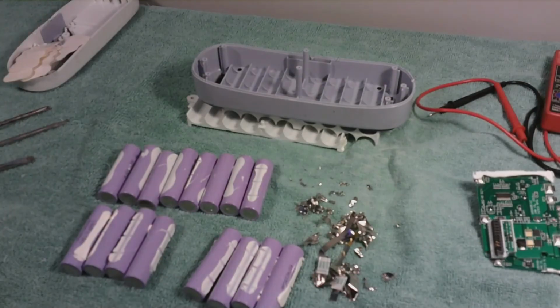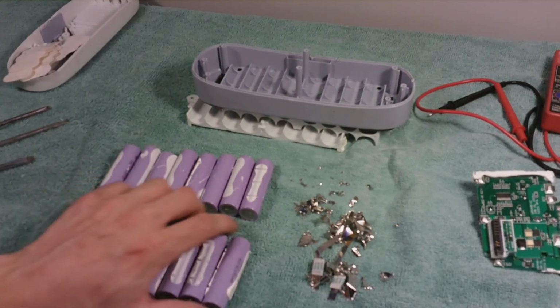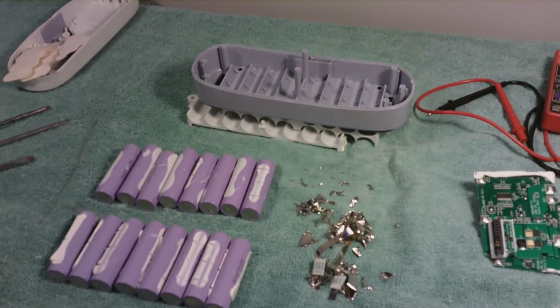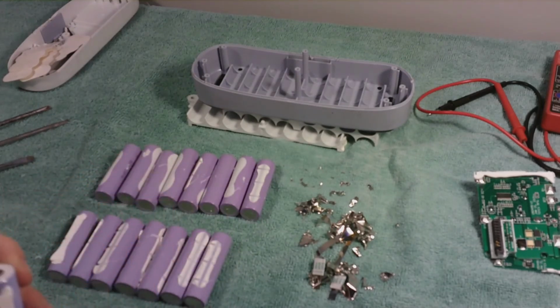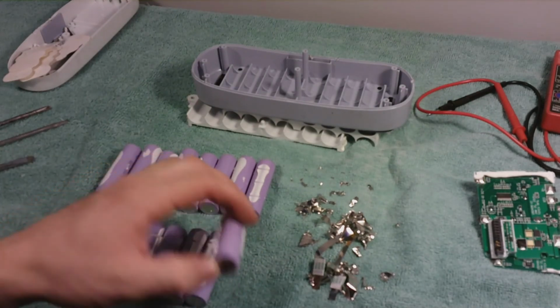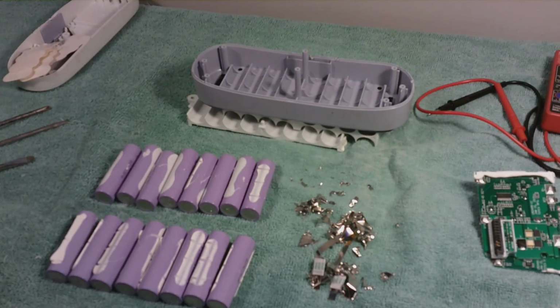And this will give me a milliamp hour, an mAh rating. It basically means that if one of these batteries is rated, let's say, at 3000 milliamp hours, I should be able to use 0.2 amps for 15 hours. So I should be able to pull 200 milliamps. 3000 divided by 200 milliamps is 15, which makes 15 hours that this battery could put out 0.2 amps. A string of LEDs, for example, would probably pull about 0.2 amps. So it could light a string of LEDs for about 15 hours, one of these batteries.